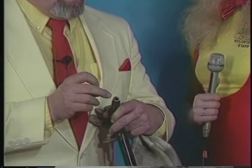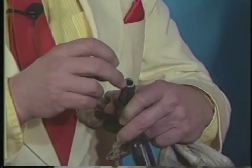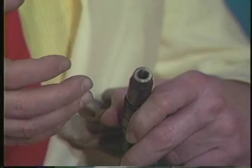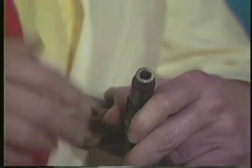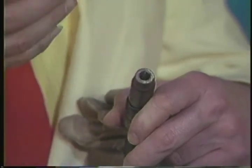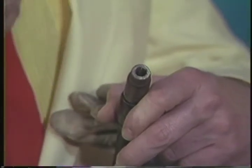Chuck, if you can come in on a tight shot here, give it a try anyhow. I don't know if we're close enough. The weld itself is surrounded with argon. Argon is an inert gas, and inert means it doesn't do anything. It doesn't burn, it doesn't aid combustion, it doesn't react to anything. It's inert, it doesn't do anything. And the advantage of that is that you don't contaminate the weld.